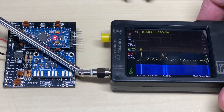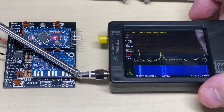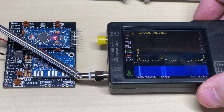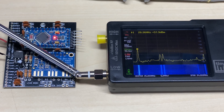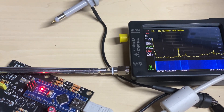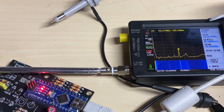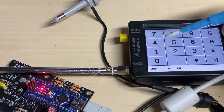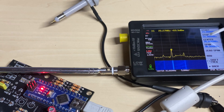As an experiment, we've got the TinySA just reading spurious signals. You can see the fundamental frequency on the left at 2330 and we can see two spikes over to the right — these are being generated by the SI or something on that board. Bear those in mind for later. What myself and DT307 have come up with is a TCXO version — a temperature-compensated crystal oscillator — and it should be a lot more stable.